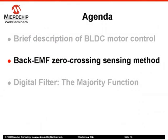In this section, we will discuss the different methods used to sense the back EMF signal. The algorithm described in this web seminar is based on the midpoint voltage reconstruction, and it is also based on detecting the instance when the back EMF signal of an inactive phase is zero. Therefore, it is important to mention that the back EMF sensing method described in this application note can only be implemented using a trapezoidal back EMF signal in order to have zero-crossing events. This method is suitable for use on a wide range of motors; it can be used on both Y and delta connected three-phase motors in theory, though certain cases of delta-connected motors may not work. It requires no detailed knowledge of motor properties and is relatively insensitive to motor manufacturing tolerance variations. It will work for either voltage or current control. The zero-crossing technique is suitable for a wide range of applications where closed-loop operation near zero speed is not required.